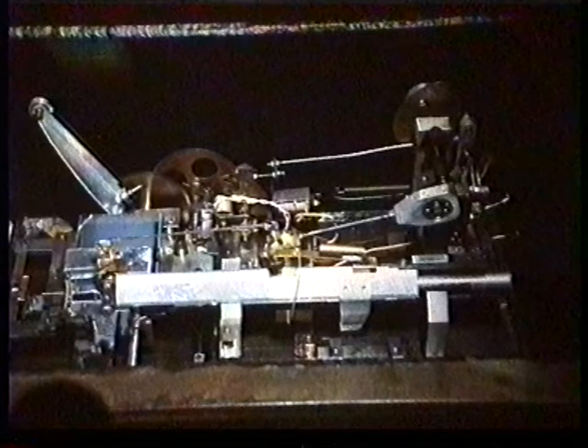Gavin has reminded me that I have not mentioned the piezoelectric creep corrector, which I fitted at a late stage in the development of the machine. Even after the screw has stopped rotating to advance the carriage one groove space, there is a small creeping movement of one or two tenths of a fringe, due to the release of elasticity in the machine. To counteract this, I fitted a very slim subsidiary table on top of the main grating table, to which is fitted the mirror of the interferometer which moves with the grating. This table is supported by frictionless leaf springs and connected to a piezoelectric actuator made from two crystals of the type used in gas lighters. A transistorised black box monitors the fringe output for any change from a set level and applies a voltage of up to 250 volts to the piezoelectric crystals to restore the grating to its correct position. The corrector is remarkably effective and operates to within 10 millifringes as far as I can tell.